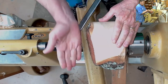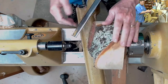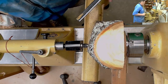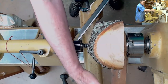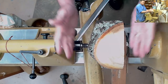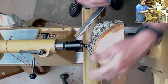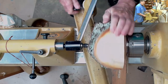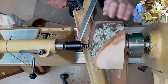A particular challenge we've got is we have a branch coming out of here, so we're going to be cutting some end grain that'll make it a little more difficult. Always bring up tailstock support. This is approaching the limits of a woodworm screw — not so much for diameter, but because of the depth of this bowl, which is approaching four inches. Four inches deep and eight inches across is what the Nova advises as the limit. So we check to make sure we're not going to hit anything and put our tool rest clear.